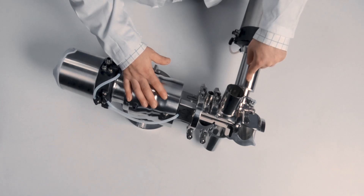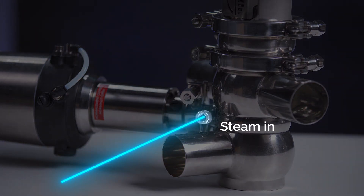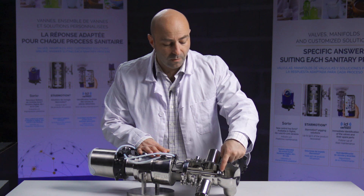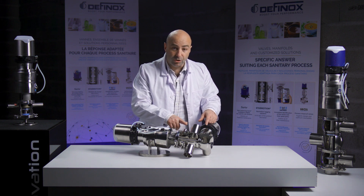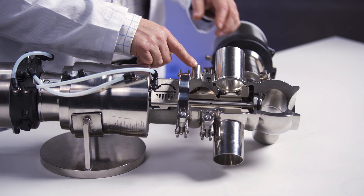On the side we have another valve, which is used to inject steam and drain exhaust steam and condensate. We have the intermediate chamber with the lower plug, which can also be lifted. The main connection port for steam is placed here, so you do not need to multiply connections and piping around the valve — everything is focused in one point, making it faster and easier to install in your process line.